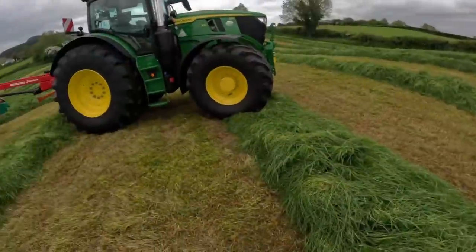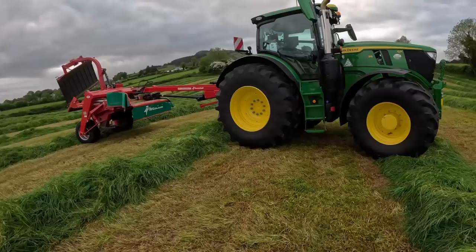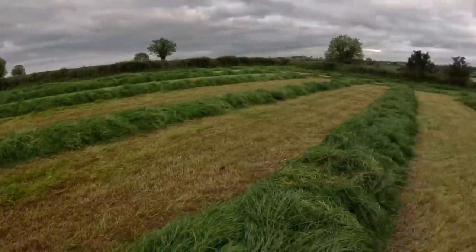Both tractors are in 540 economy, but it will be interesting to see how it performs on the GF with the 1000 economy. Hopefully it'll be using less diesel. I think there's a better lock on it, especially after doing the mowing with it this year, more so than early in the year. I was going slow, the ground was a little tricky, I was trying not to mark it. The ground's dry now at the minute. You can swing around and turn, whatever you want, and it's not marking it. I think there's a better lock on it than the 6930, with the way the wheels are, because I was able to maneuver the mower better with this than the 6930, which I'm very surprised at, and pleasantly surprised.